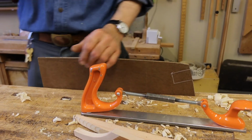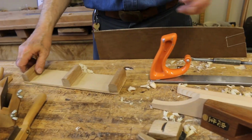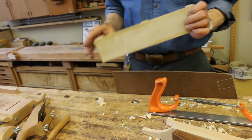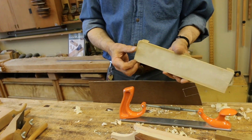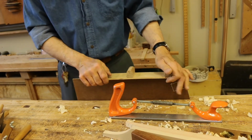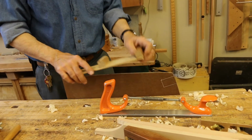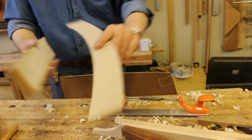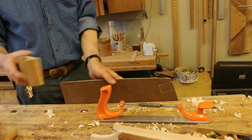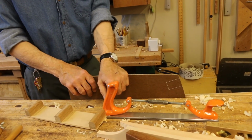One last thing. Besides the sanding blocks, as I said, you can use the offcut for a sanding block. I've made this little one up for fairing long curves. Glue sandpaper to the bottom, piece of flexible plywood. I think this is actually bending plywood. With a couple handles on both sides. So you can get the convex curve, and then I won't quite do this curve, but you can press down in the middle to get a concave curve. And that's for removing and smoothing any high spots left from the plane work, the edge work.